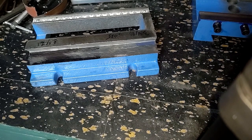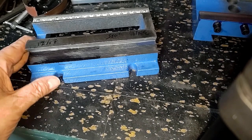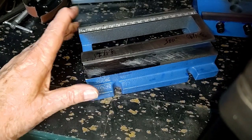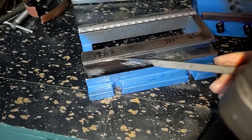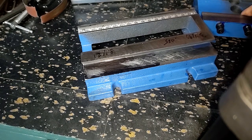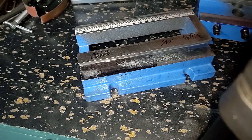because what you really need to do is come back down in here, in this groove right here, and make a rounded section that's deeper than any possible angle that this could reach, and that way it will never bind.